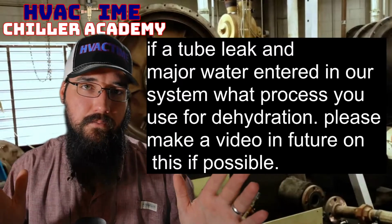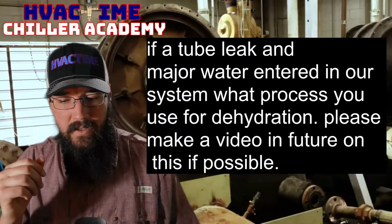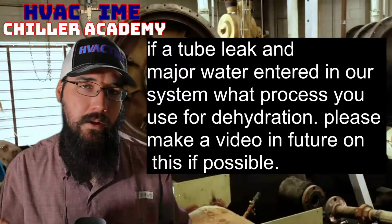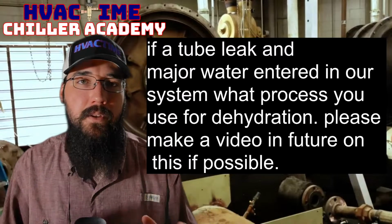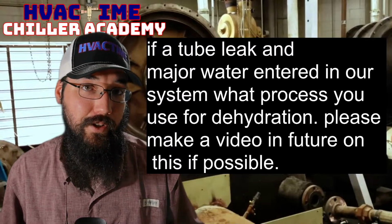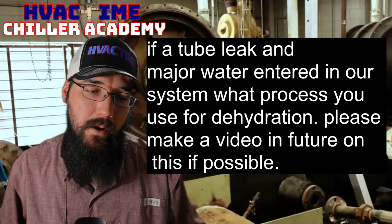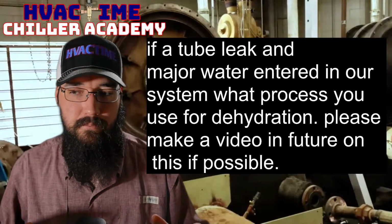So once you mitigate the refrigerant, if you have any refrigerant in there at all, drain it down. Now, it depends on how long it's been able to sit in there. How long of a span did it go? In some of these cases, I've seen it where they literally allowed the whole chiller to fill up to the compressor and it sat there for a period of time. By period of time, I mean weeks to months.